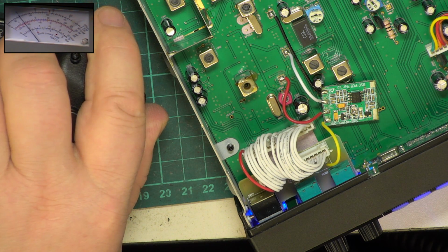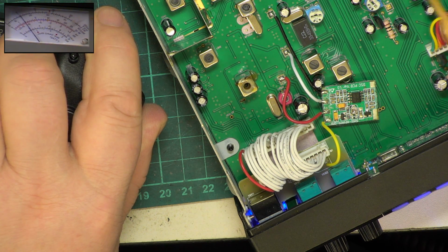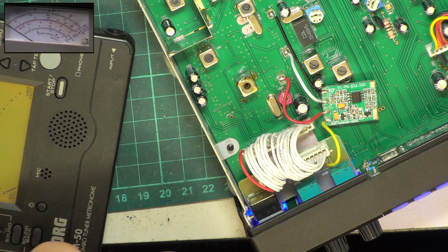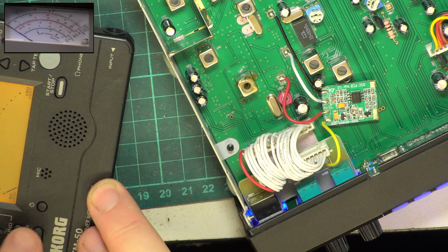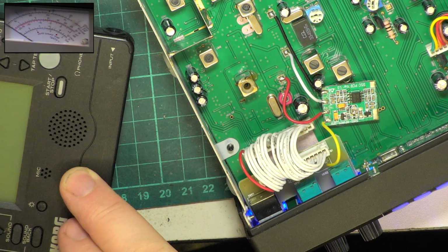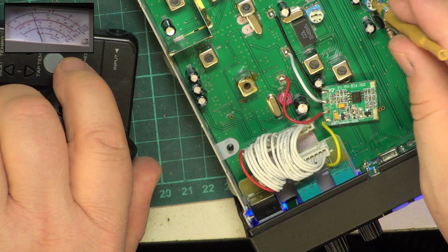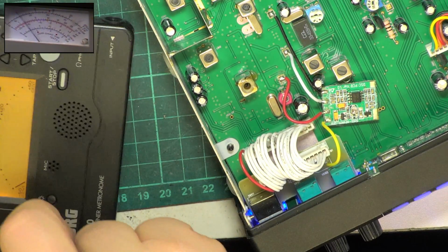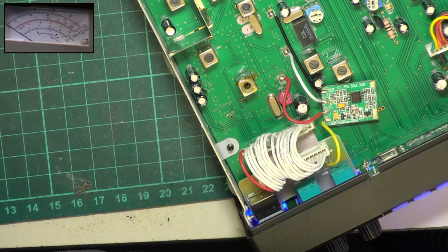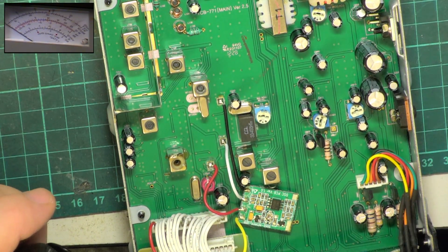So we've got about, Warlow, we've got just over 1. So we'll just turn that up a bit, and it's this one that adjusts deviation. So we'll turn it up to about there, and then I'll just do the whistle test. Warlow. Now that's too high, so go back to this. Warlow. Just fractionally too high. Testing 1, 2, Warlow. That's it. We've got that absolute maximum of 2.5, averaging around 2.2. So that's that. That's come up fine, because you know some radios don't even have the deviation, which will come up. Cobra, you can take note there.